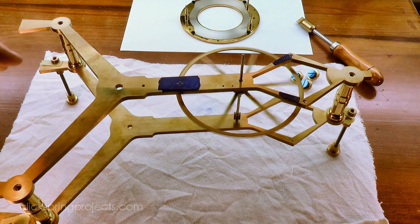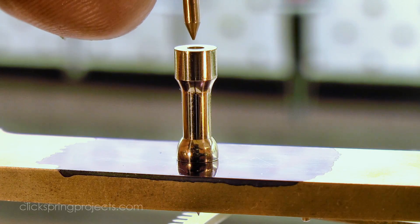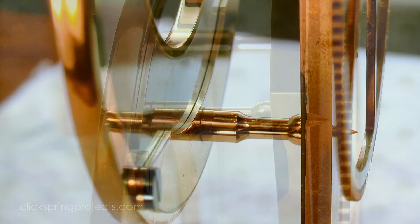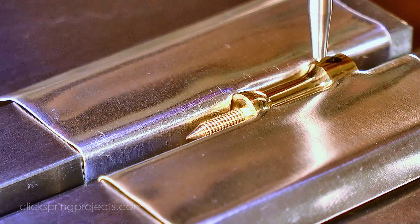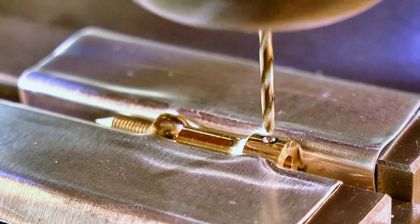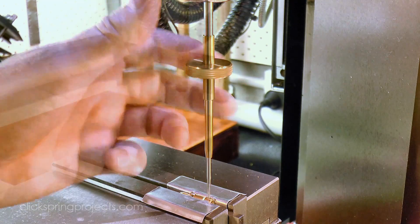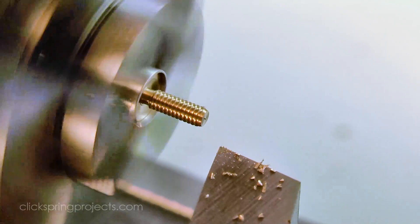The pillars can now be screwed into the front plate, and we can have our first look at how the dial assembly fits in place. Each pillar now requires a set screw to hold the dial assembly in position, and I've decided to align the top two screws so that they face upright. For convenience of access when the clock is in service, the lower set screw will be aligned to the side. And this is where I used the point I formed on the end of the pillars to ensure that the cross holes are aligned with the axis of the part. Now that the point has served its purpose, it can be removed and a polished surface put in its place.